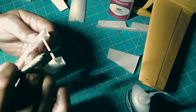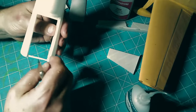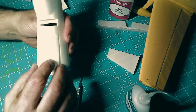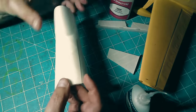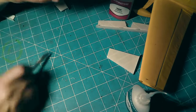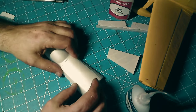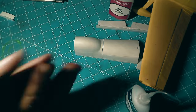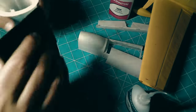I designed this model for using lightweight PLA, and it's pretty commonly understood that lightweight PLA has a terrible time with retractions. So my solution to this problem is anywhere that I have a void and a body, I will just create an indention that's designed to be cut out later that creates a much cleaner print. So this is what you're seeing me do here.